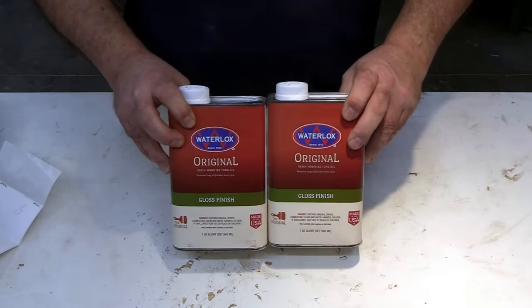The other thing is, in one of my previous videos, I mentioned that you've got to be careful that if you go too far with the rig this way, this could slip out of these captive bars in the back. So my temporary fix right now is just to put this small C-clamp on there. That should prevent that. But I noticed that this is hollow, so I'm going to tap this, put a bolt with a big washer in it, and that way it can't fall out in the future. When you want to remove the rig, it's just a matter of unscrewing it and then sliding the rig out.